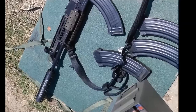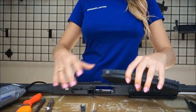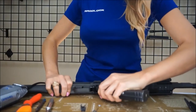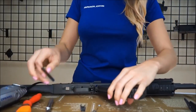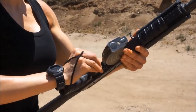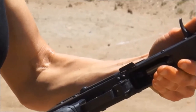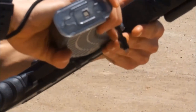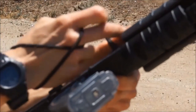Make sure you keep the same profile the AK RadLock has as you remove the material. Then insert a 10-round magazine that you will be using with your rifle to test fit the AK RadLock. Manually move the AK RadLock to lock the magazine in and out. If the AK RadLock is rotating freely and it can lock and unlock the magazine, then you are ready for the final fitting. However, if it does not rotate freely, you may need to remove more material, either from the top or the back side. Remember, do not remove more material than you need to. Always test fit with every minor adjustment.